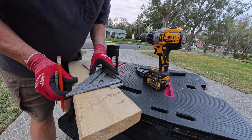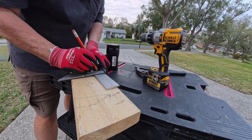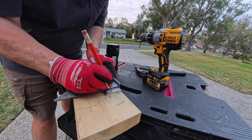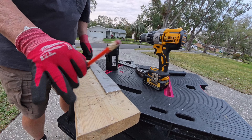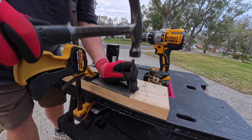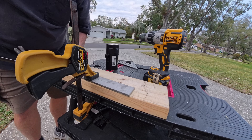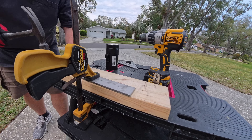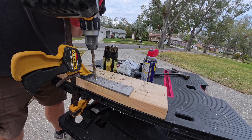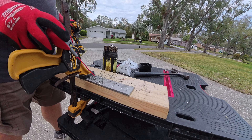I have a 20-foot portamast — 20 feet elevated out of the concrete sleeve in the ground. On top of the portamast, I've installed the topper accessory, which has a female 3/8 by 24 thread. I'm going to attach a stainless plate to the top with three holes drilled in it so I can orient it however I need. I'll go through the center hole and attach the matching unit on the LEFS 8010 to one of the outside holes, to get about six inches of separation between the antenna and the portamast.